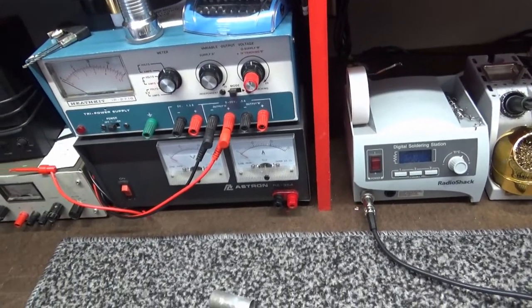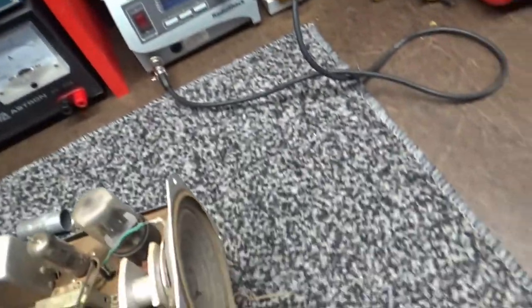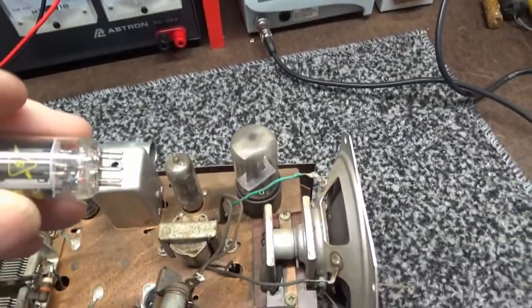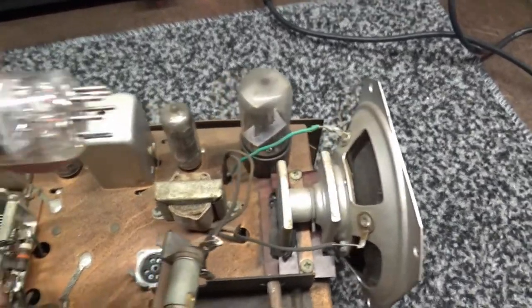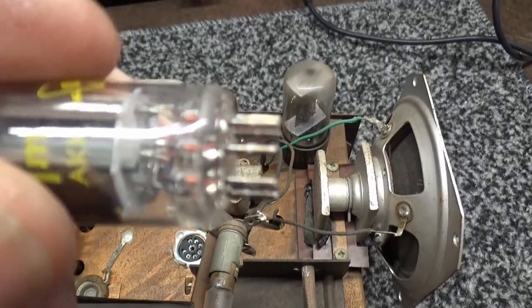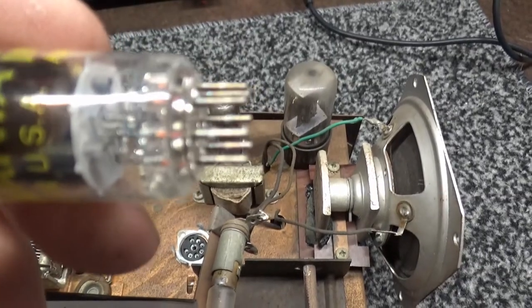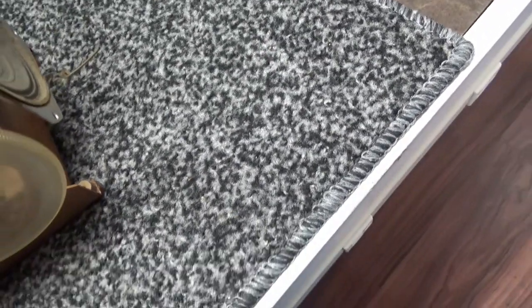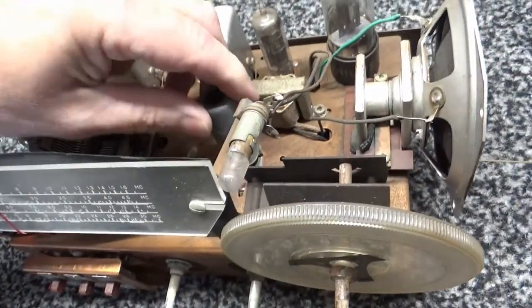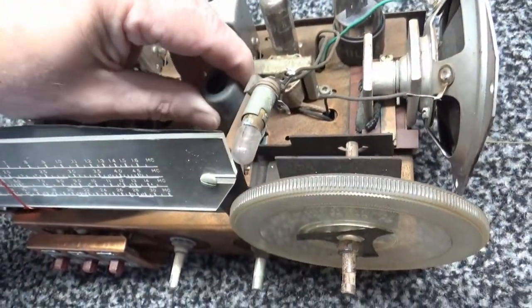Another Sylvania. It's got an AKK on there. I honestly don't remember my tube code. I don't know if you can see it good or not. See the white on there. So, a little oxidation on there. We'll clean it off with a little deox. I'll do that off camera because that gets kind of boring. Anyway, that's your detector.